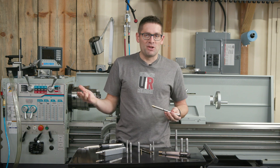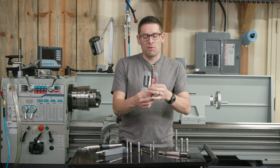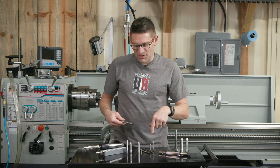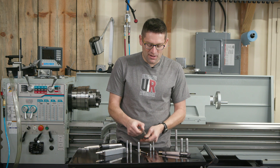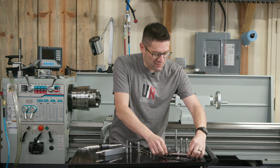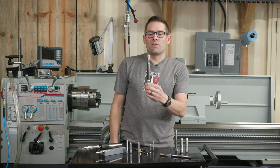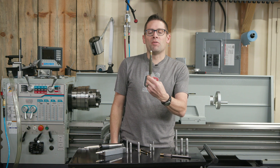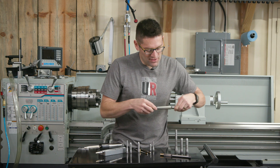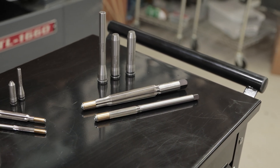I just have to say — this stuff is really cool. I love the 50 BMG because of how big it is. This is the free bore reamer; it's got a 12-millimeter shank, the same as the shank on the body and neck reamer for the regular gauges. It's just of totally mammoth proportions. And this is the body and neck reamer — just take a look at that. Behold the scale of this.